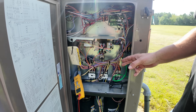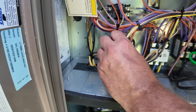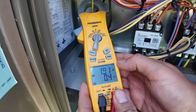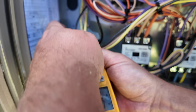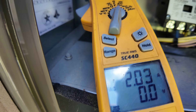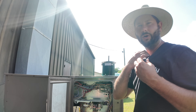But we could measure the other line, which would be the other side. So one of these wires is for one fan: 1.9. And here's the other fan: 2. So 1.9 and then 2. This one is pulling a little more amps, and I bet that's the motor that I think is bad — the one with the loud noise.